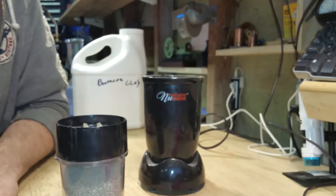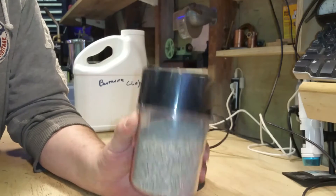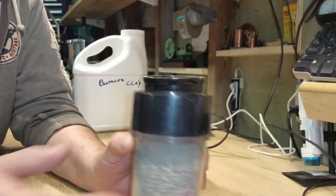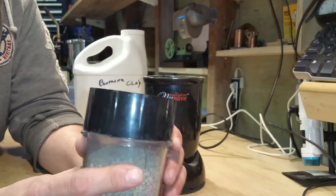In the ingredients, the ratio is 10 to 1. The second ingredient is sand — I've got some really fine silica sand. So that's one part clay to ten parts silica sand, and then you moisten it very little. I'll show you that as we go along.